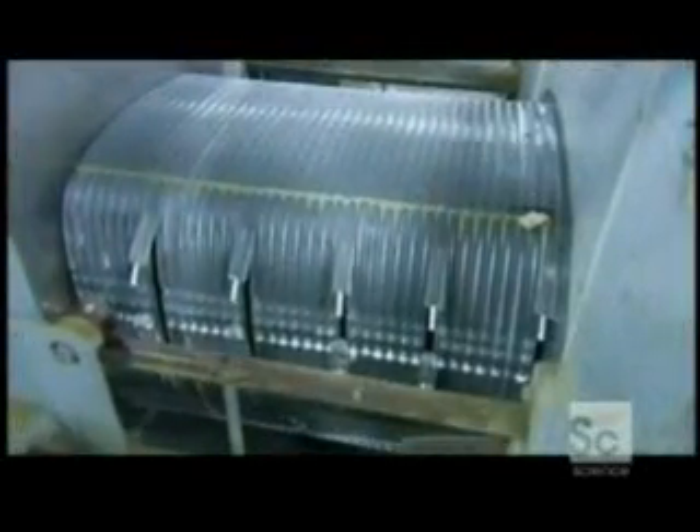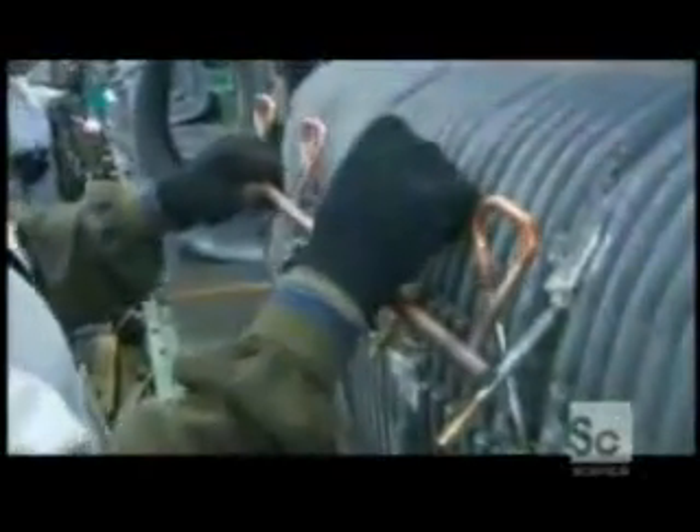The pipes that feed these circuits are made of copper, but copper doesn't fuse directly to aluminum, so workers must first solder on transition tubes coated with a zinc aluminum alloy. Then they attach the copper manifolds that distribute the refrigerant to the circuits.